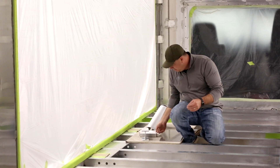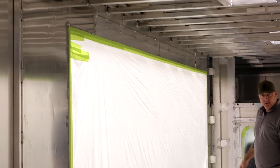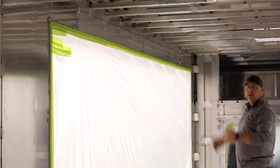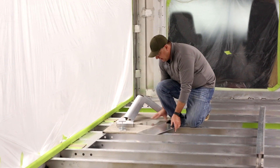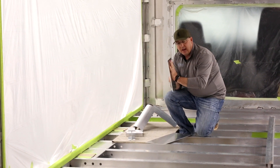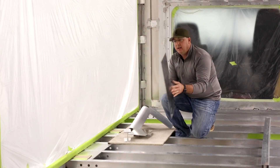In addition to that tubing, at all the key points around the slide-outs, we use quarter inch plating to basically gusset and tie all those corners in. It prevents any kind of sag in the slide-outs — this is only about a 16-foot slide-out, but we do all the way up to 22-foot slide-outs. When you get into those big slide-outs, you do have to be concerned and aware of the sag, and this ties those corners in and also keeps everything nice and straight. I don't know of anybody that's doing that in the motor coach industry period. It's quarter inch plate on the inside around the corners, quarter inch plate for all our plating and gusseting to add strength and rigidity. Your slide-out bracket goes onto this, welded on top on the inside — it's incredibly strong, not built like anything I've seen.